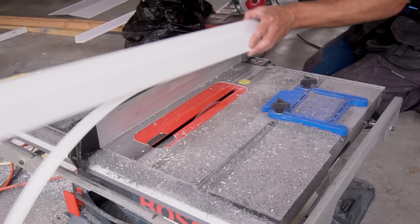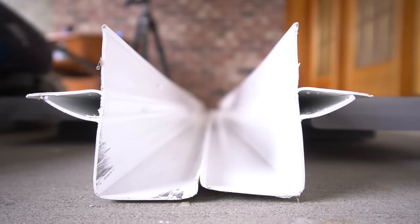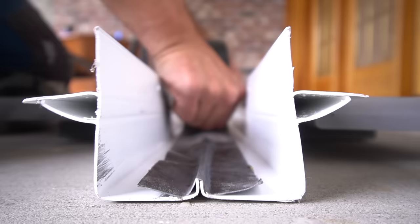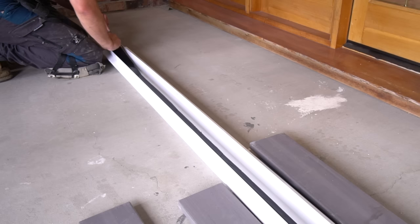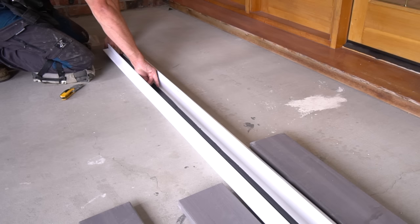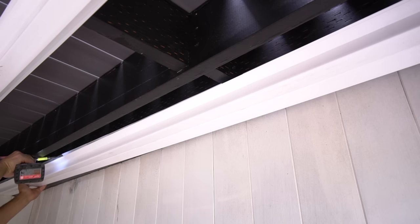The easiest way I found to do this was to score one side of the combo bracket and remove the tab portion. That way I'm able to run it through my table saw and with the help of another 2x4 I can stabilize it and cut a perfect seam all the way down. You do want to leave about a quarter-inch lip on the side you're cutting, because that's where the tape comes in. This is the Protac tape from TimberTech — it's extremely sticky. This is the same product we applied to the top of our joists to help the longevity of the joists, but here it's adhering both systems together while also ensuring a watertight seal. Once applied all the way down, we cut off any excess and position it appropriately.